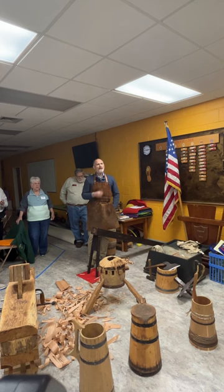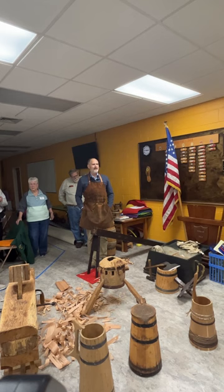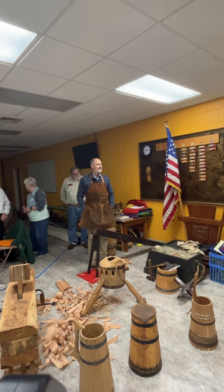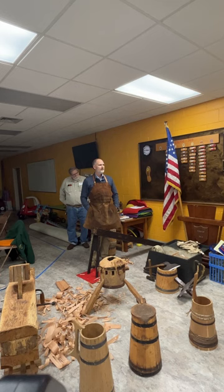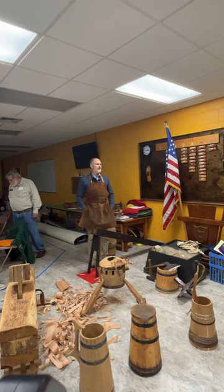Pine does work — white pine is very good. Yellow pine was used for cooperage for things like tar and turpentine barrels, but it's very, very resinous and it dulls your tools very quickly. I've made some things out of longleaf yellow pine, but I won't ever do it again. Even oak, which is one of the harder woods, doesn't dull my tools nearly as fast as pine does. Longleaf pine is fantastic and has a lot of uses, and it can produce beautiful quality materials, but it's very resinous.